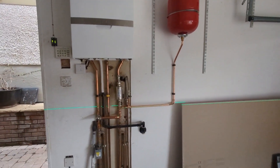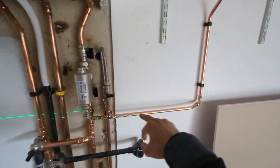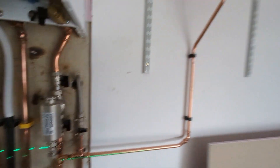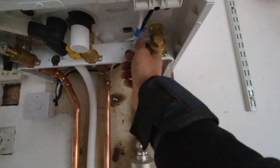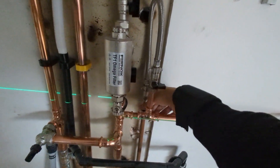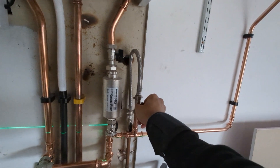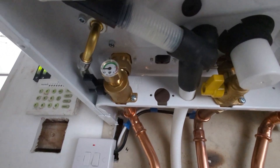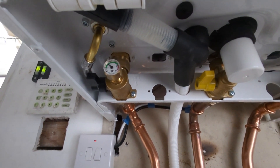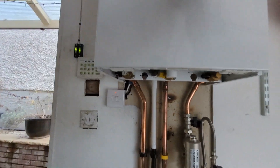The vessel is all fitted and piped up. I tried to use one bit of pipe but my bending skills aren't quite there yet, so there's one elbow and a T to add the filling loop back on again. The vessel is up on the wall. Let's open up the flow and returns, top up the system pressure, and test for any leaks. Pressure seems to be about right — shut the filling loop off and it's back on.